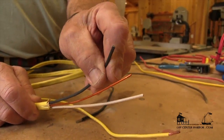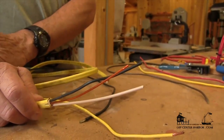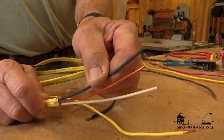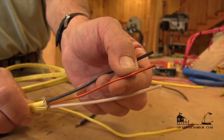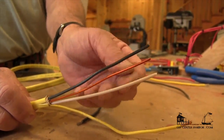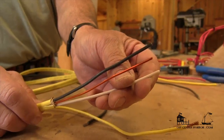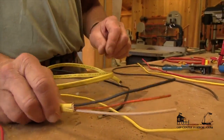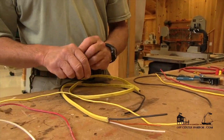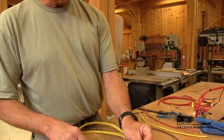Type 1 is not appropriate for marine use. The reason is the wire itself, being single strand, will break during vibration and then we'd have a bad connection. So we don't use single strand Type 1 wire on board a vessel. In fact, both the Coast Guard and the American Boat and Yacht Council prohibit the use of Type 1 wire.